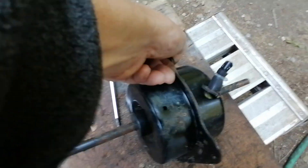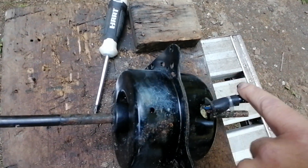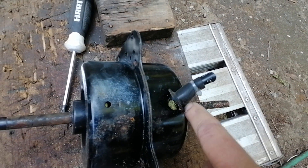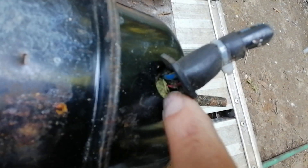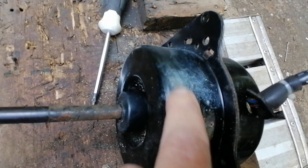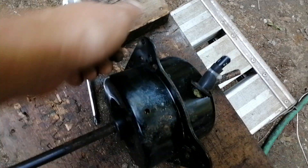This is the bottom of the motor. These rubber boots from the electric wires — 90% of the time they're all cracked apart. This one is actually pulled out of the case, so you've got a big hole going directly into the motor. On the other side there's a weep hole — this hole goes right into the motor. If you tip the air conditioner and spray it with a hose, water's going to go right in there. You don't want to do that.